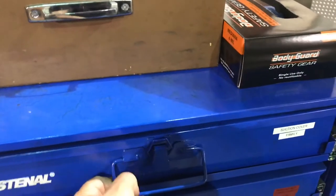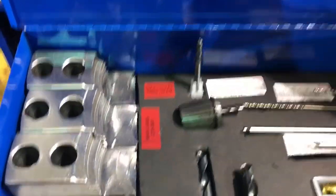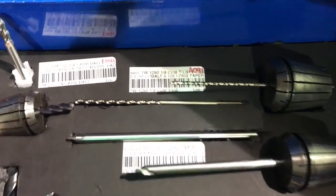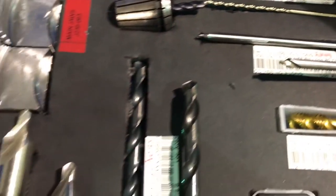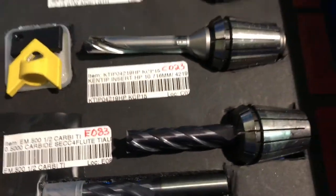Here's WorkCenter 52. This drawer is the suction cover nut family. You can see here we have the jaws, and we have all the live tooling complete with spare parts. Labels show what they are and what location they're from. Along with each tool, we also have what tool station it goes in — here with the red labels. Very quick change setup.